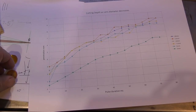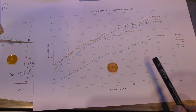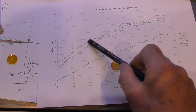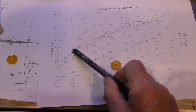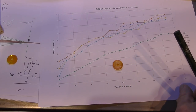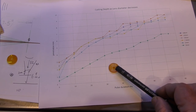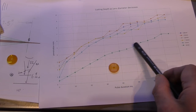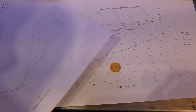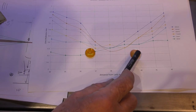Then we look at what we've done to the power that comes through the middle of the lens. This is the penetration we got with our final iteration of this lens at 3 millimeters diameter. Everything else was transmitting power normally. There's a little bit of variation, and the 18-millimeter lens is sitting somewhere in the middle of that pattern. The net result is that there is no reduction in power as I start reducing this diameter — the only time I experience a reduction in power transmission through the lens is when I go from 5 millimeters down to 3 millimeters. I think that's pretty conclusive evidence between the two lenses: one says we can't cut but we can focus; this one says we should be able to cut but not focus.